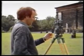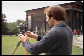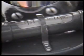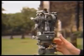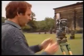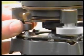Turn the bubble tube to its first position and check to make sure the bubble is still in the middle of its run. If it isn't, put it in the middle again using the first two foot screws. Return the bubble tube to its second position and again check it. If the bubble isn't in the middle of its run, use the third foot screw to adjust it. This procedure is repeated until the bubble is in the middle of its run in both positions.